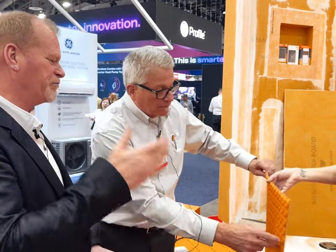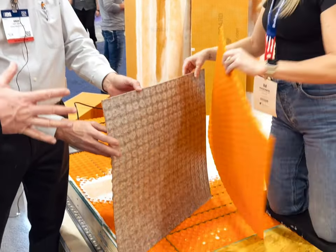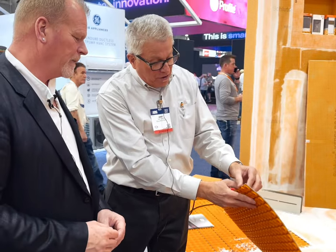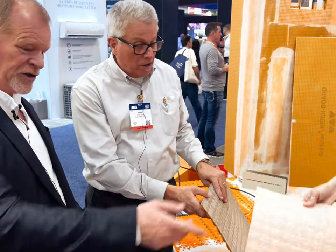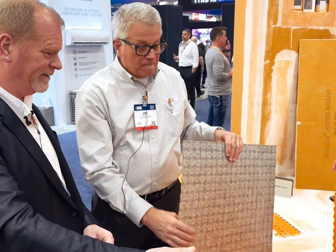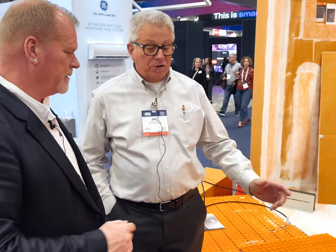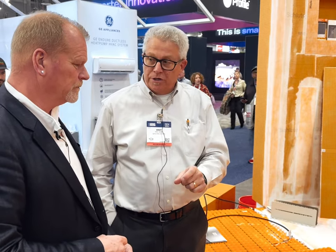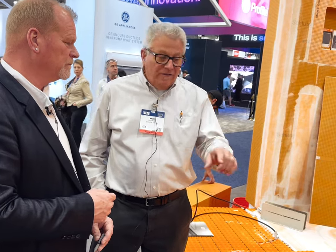It excited me. When I saw it I knew right away — this is brilliant, a thermal break and a sound barrier. It's obviously a bit bigger. Not by much, but you can clearly see the thermal barrier and the sound attenuation mat on the back in lieu of the fleece. And you can still snap your heating cable in, so you have your in-floor heating. It's just simple. This is great for homeowners and DIY. Also, there are a lot of places in the United States where the electrician has to run the cable — and there are actually places where even putting the cable through the mat has to be done by electricians.